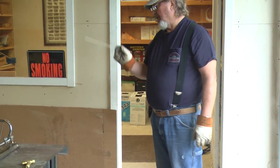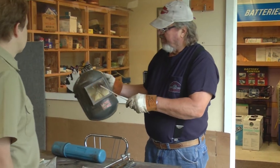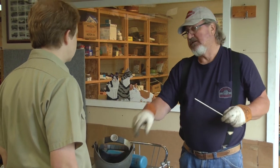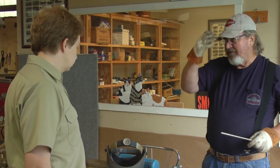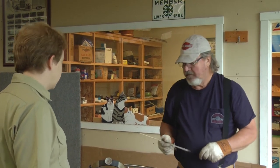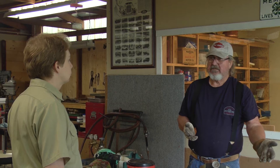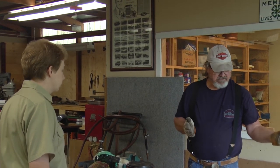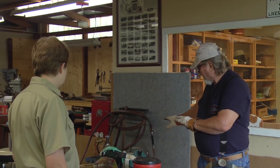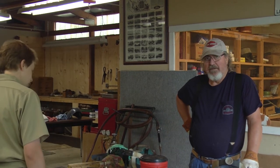I would hook that up and then just practice with it. Get a good helmet — the Huntsman ones are light, almost like a cardboard type. I like the big shield versus the little one because you can see more. If it's not perfectly down, or you have to put your head under something, or you're welding a piece of equipment, you can see a little better. Welding lesson in a nutshell. Now you'll understand when you look in the manuals what the number system means, a little bit about electrode storage, the basics on your torches.